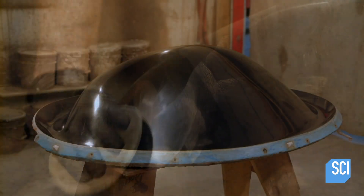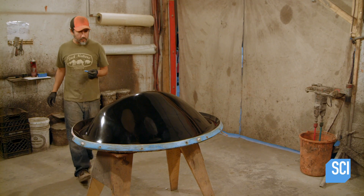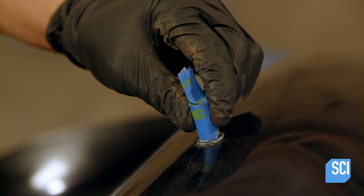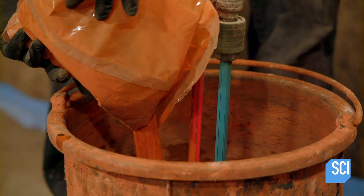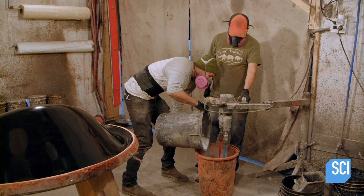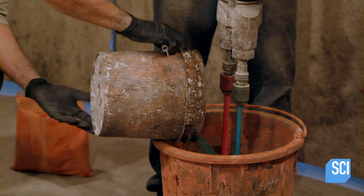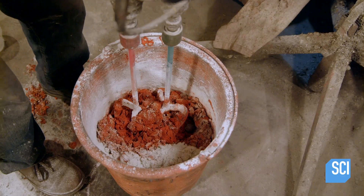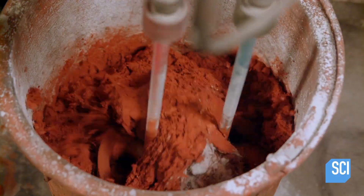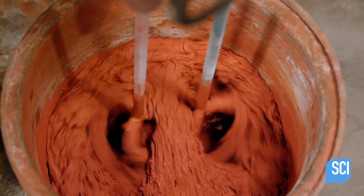The first step is to coat a fiberglass mold with a release agent. Once a rubber insert is glued into the drain hole, a technician mixes the ingredients for the casting material together. Ingredients include pigment containing metal oxides, which prevent color fading, a concrete mix containing a blend of fibers for extra strength and resistance, and water containing proprietary additives.